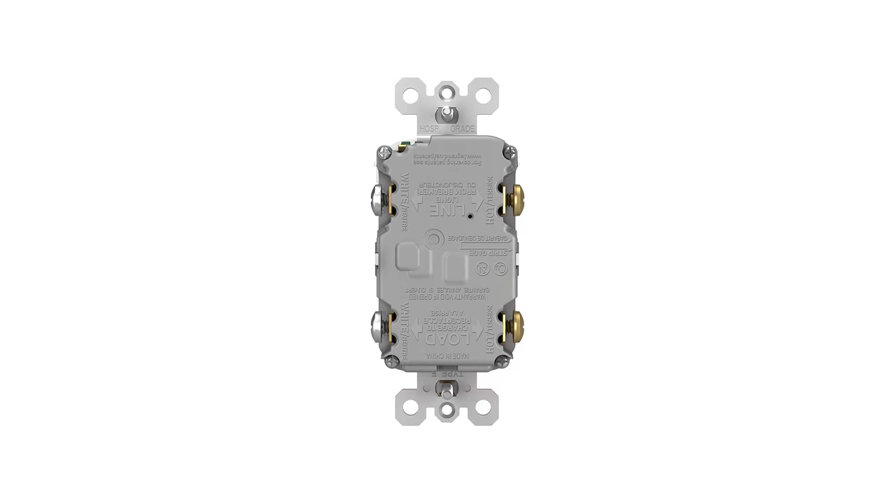That definition covers any boxes around any kind of electrical conductors — equipment that is metal itself. You'll see things like pool equipment, where we run an equipment ground inside but there's also usually a grounding conductor that goes to the body or frame of the pump itself. In a switch box or receptacle box, the reason we bring a ground in is to hook up to the metal strap of the device. A duplex receptacle is mostly plastic, but the strap — or yoke in code — is the part that holds it onto the box, and there's still metal on or around the device. We have to make sure that metal strap is connected to all the rest of the metal parts, and the box enclosing the conductors also has to be bonded.